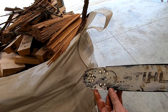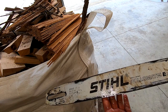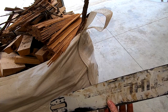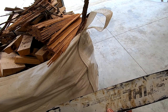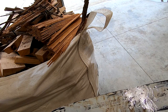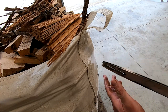This is a German-built bar — they're the real high end, the ones you'll find on pro saws. Another thing I mentioned earlier is I usually flip the bar every time I change a chain. I run carbide chains so that's a bit longer between changes, but every time I change the chain I flip the bar. That way it wears the other side — primarily you cut most on the bottom side, so if we flip it every time we just keep changing that wear surface. Of course the oil ports are located so they align correctly every time.